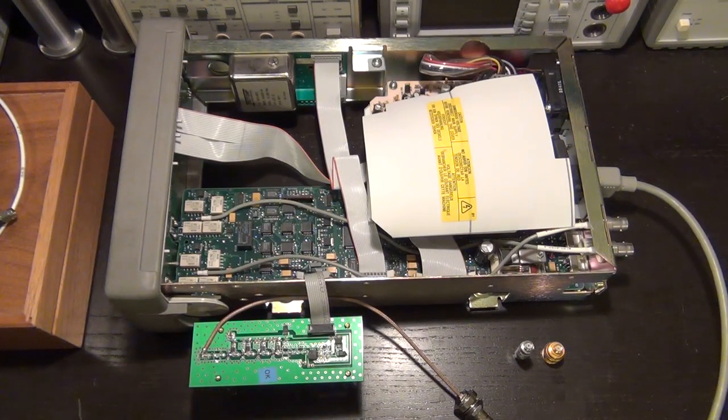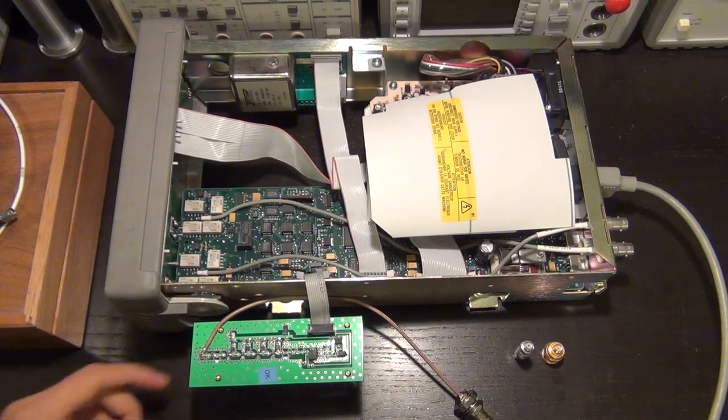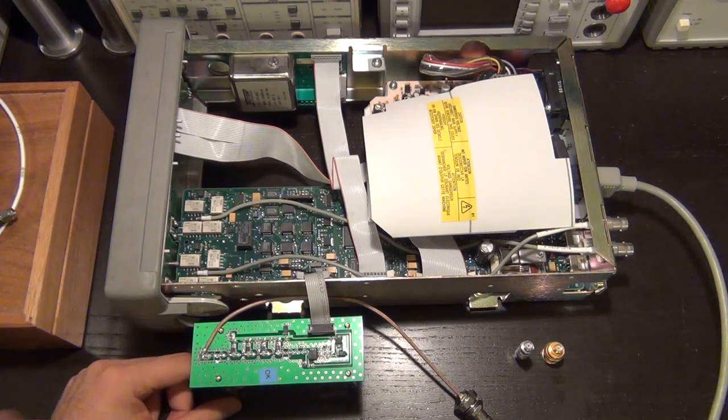And then later, if I want to measure the large signal performance, I can increase the input signal power to make sure that I can saturate the last stage. That way I can measure P1 dB and Psat, the saturated output power of the amplifier, which is a very, very different measurement. You have to keep that in mind. Not only will the impedances change, but also the behavior of the circuit, the frequency response of the circuit is very different in large signal than it is in small signal. So you have to take all of those into account when you're making a measurement like this. So there's a lot of things to take into consideration.